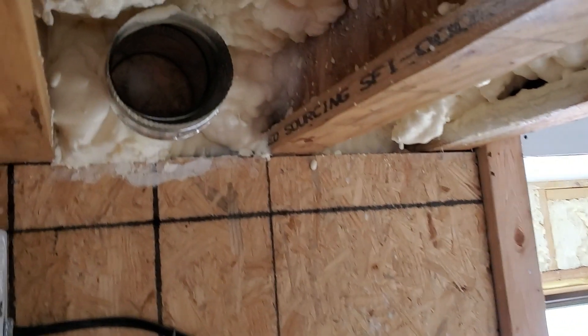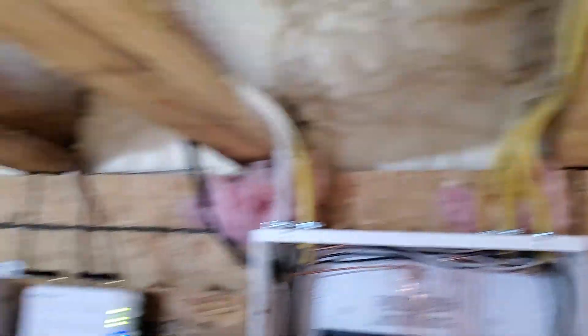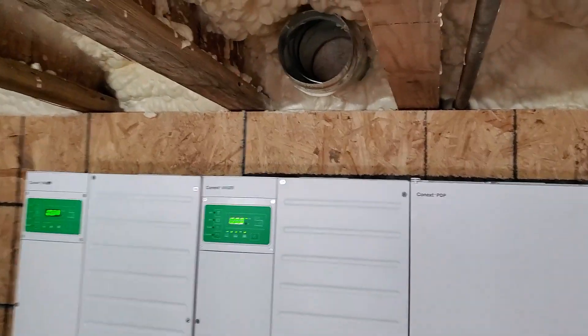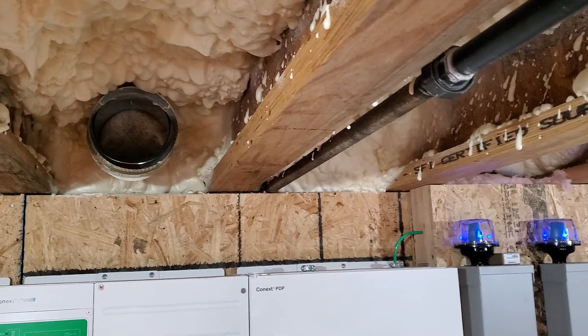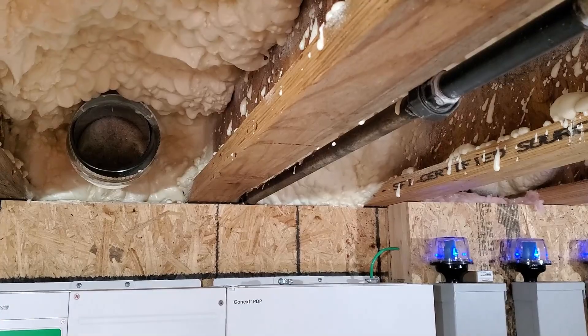The first task is I put in these access vents. These are six-inch vents. You're required to have them far enough apart so that your intake and your exhaust do not just cycle back through each other. I think it's only supposed to be five feet apart, and I'm probably good at ten feet here.